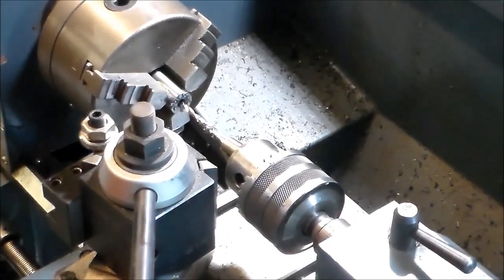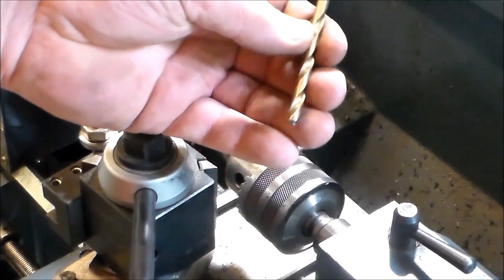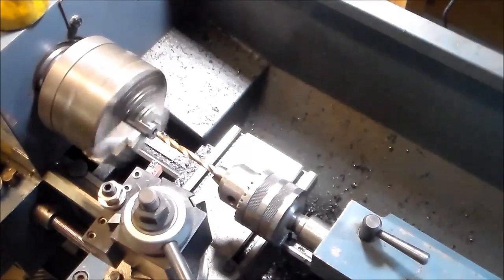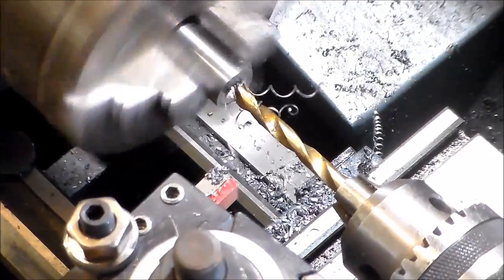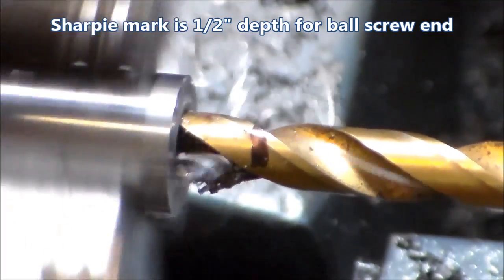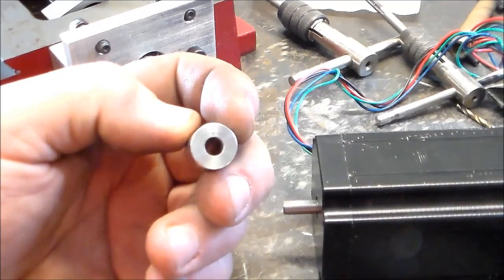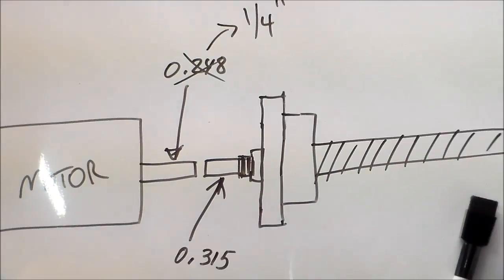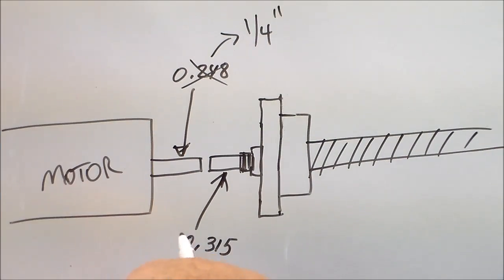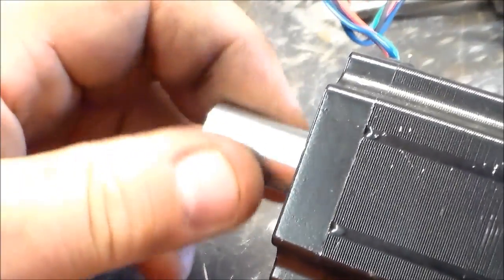After that pilot hole, I'm going to go back with a letter C drill bit and sneak up on that 0.248 dimension — I don't want it to be sloppy. There's my motor coupler so far. This side I ended up drilling out to be a quarter inch. I tried to sneak up on it with a C and then a D, but I ended up going quarter inch anyway. My other one ended up being five-sixteenths. But it fits great on the motor — you almost have to be careful once it gets stuck on there, it fits so perfect.